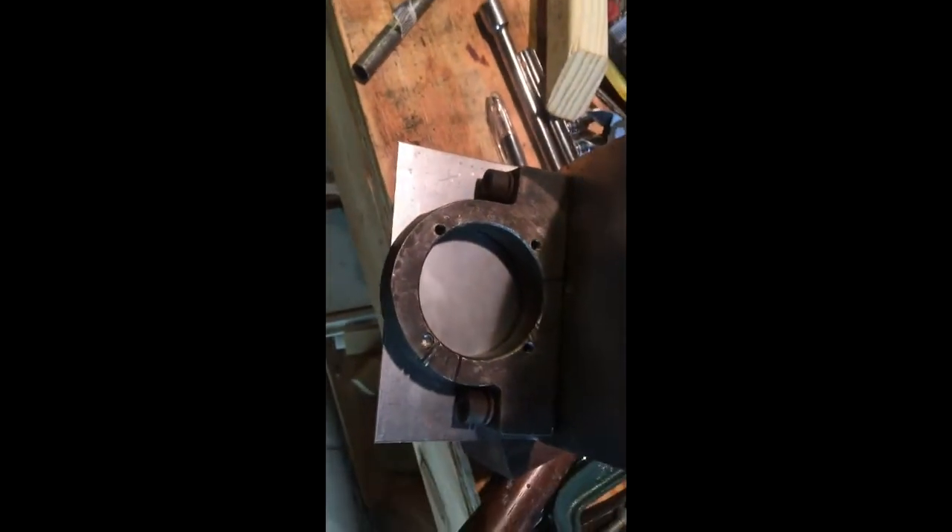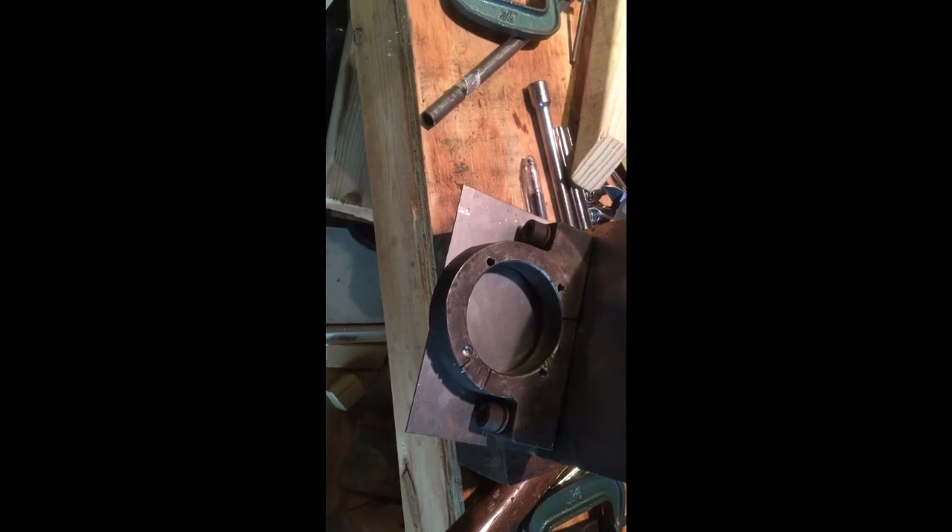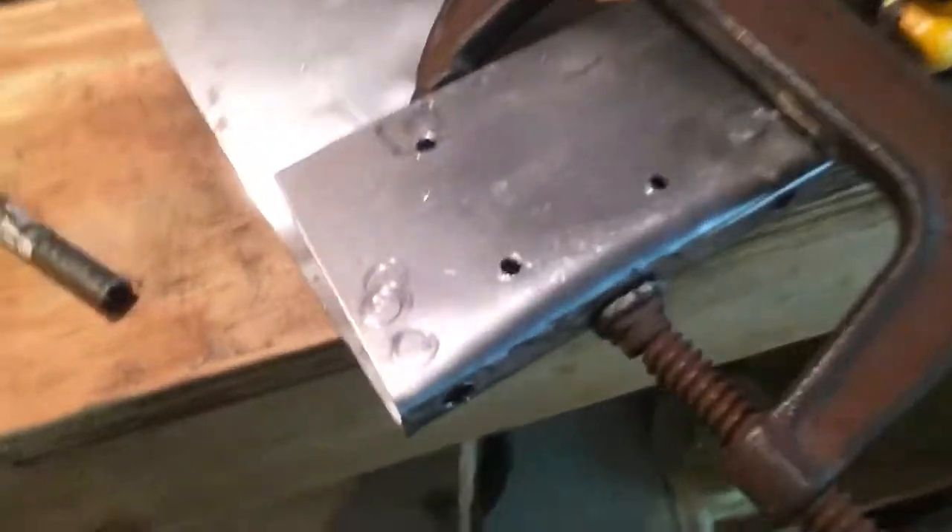Progress. I've got a piece of sheet metal that I used my block to bend the right angle on, and then I used my drill press to drill these holes out to get them all nice and lined up. Now I'm going to drill out the through holes so they can line up easier, and then bend this piece of metal down over the rest of this and use this bearing as a hanger for the axle. After a lot of pounding, I've got my holes drilled through for my three holes — right to my bearing hanger. I've got it wrapped around; I just need to cut it to the right length.